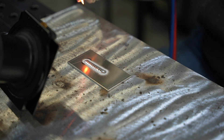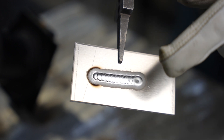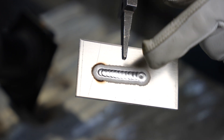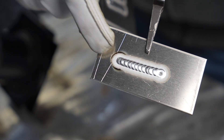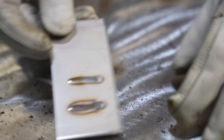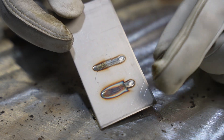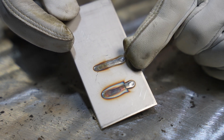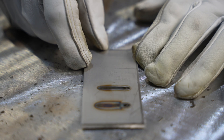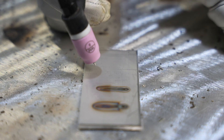It's not ideal for aluminum, but it sure works fine if you want one setup as a good middle of the road — you definitely get a clean bead. The big thing to point out is this wider etching band, which isn't really problematic unless the appearance bothers you. Now on DC with the same machine settings: this was with a number 5 cup, this is a number 12, and now I'll run a regular number 8 cup at the same amperage and travel speed.